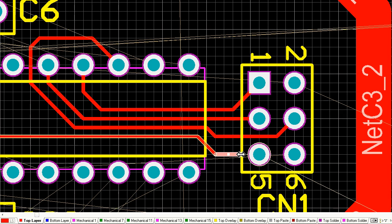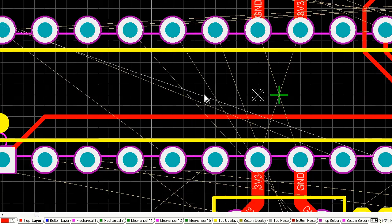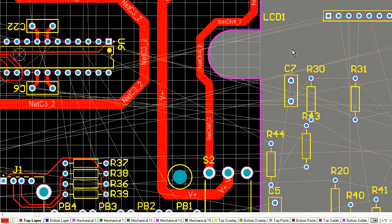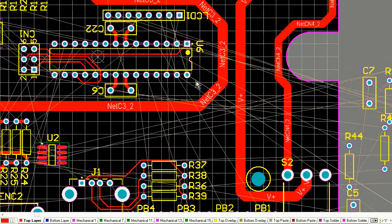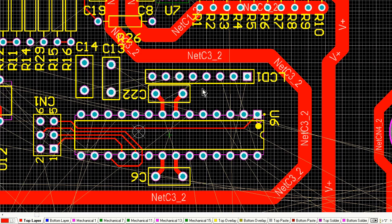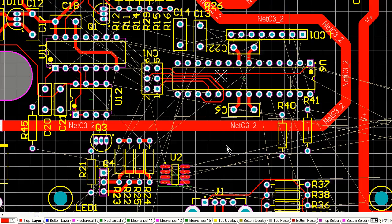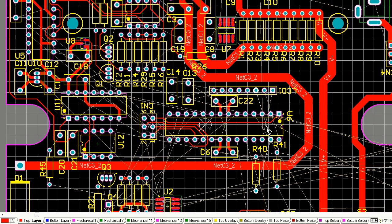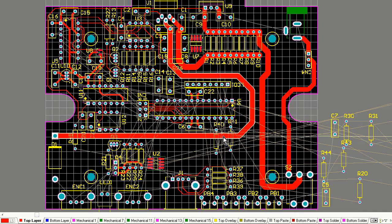That's right, I added a second bypass cap because there's power on both sides of the chip. So I added an extra bypass cap, and there I am attempting to rotate the chip around. You'll find that that's definitely not the final orientation. I will end up rotating that chip again. As you'll see, pin 1 is on the right-hand side at the moment, U6, directly in the center there.